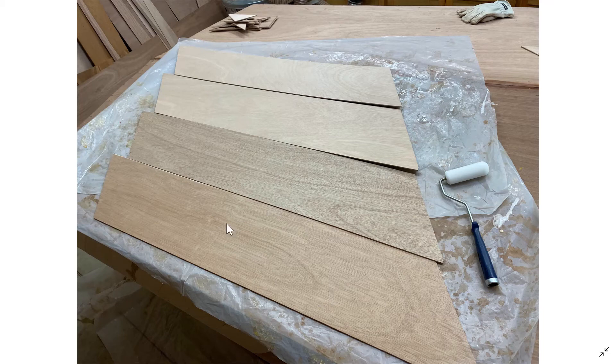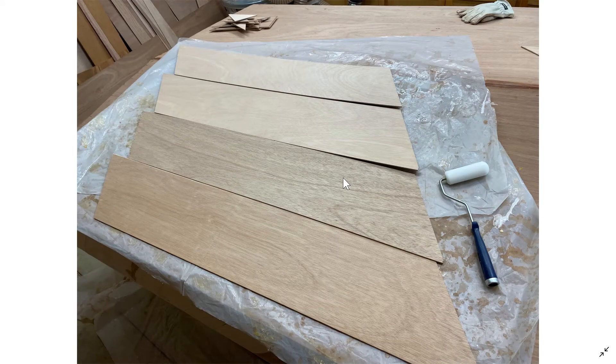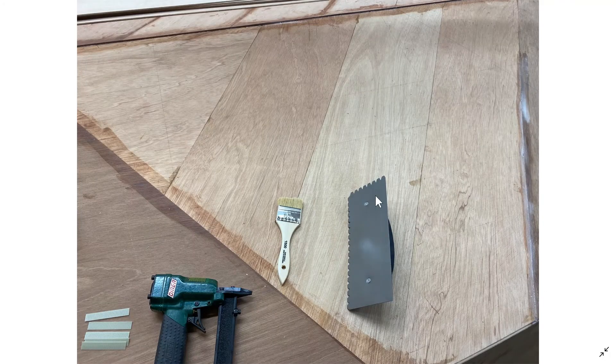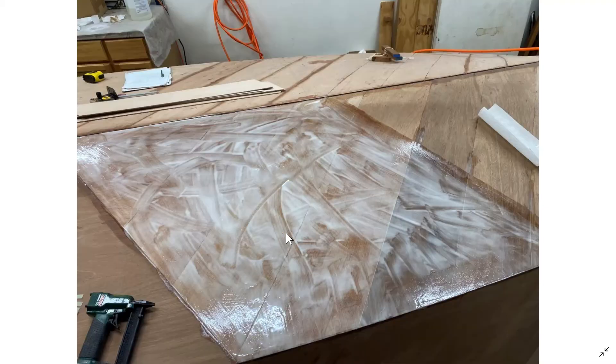Here I'm showing the boards ready to go — four boards flipped over — and I apply the encapsulating epoxy. I do talk about that in another video about how planking pieces are attached. Here's where those pieces are going to go. I've got my composite nailer ready, and I use a chip brush with cut-off bristles to first encapsulate the area on the boat, then spread the thickened epoxy with a trowel, then use the chip brush to spread it and get the edges.